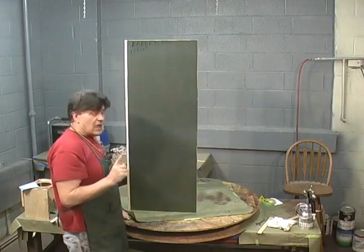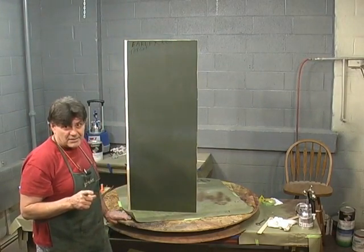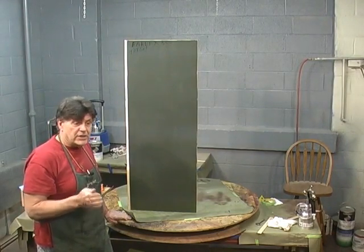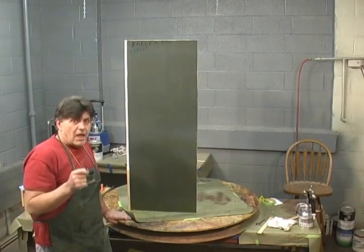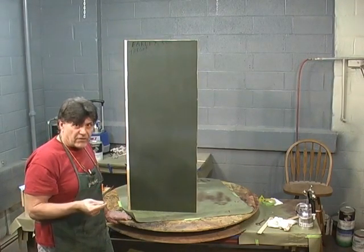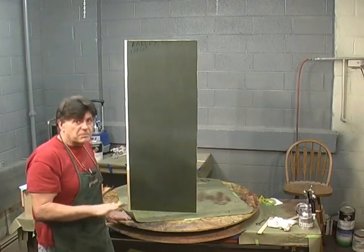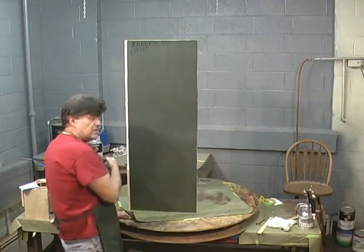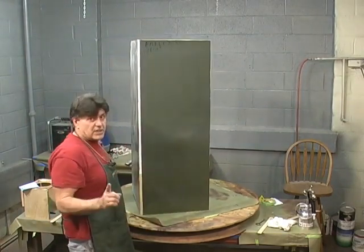Now, again, practice spraying vertical. Takes a lot of practice. Told you before, I can't teach you how to spray. I can only teach you about it and give you pointers. The main thing I want you to understand is working with your viscosities and your needles and your air pressure, speed, how fast you're moving, getting used to that trigger. It's not hard, but it does take practice.